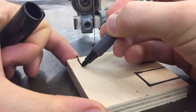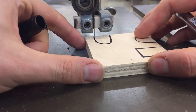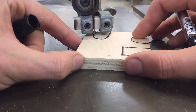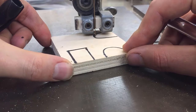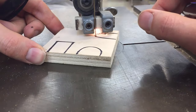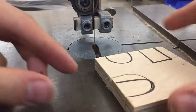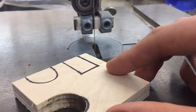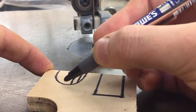If I try to cut a curve like this, you're going to see that when I get into the tight part of the curve, I start twisting the blade. You see how the blade's moving? I'm going to have sparks. And no matter how hard I try, I didn't make the curve. So the bandsaw can only cut about that tight of a curve. This one here is actually a little bit tighter than that, so I'm going to cut straight lines over and over again — called relief cuts.